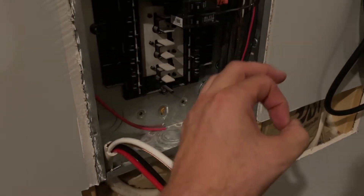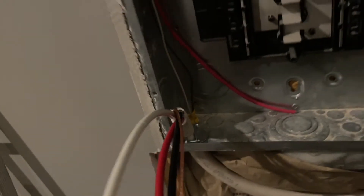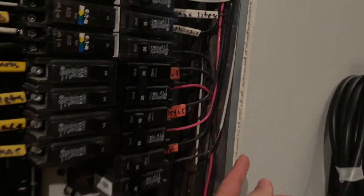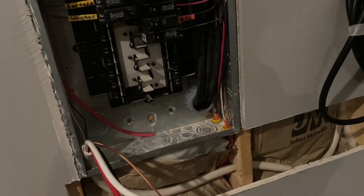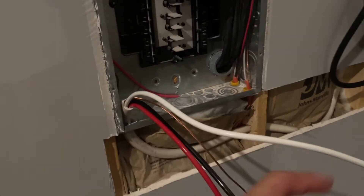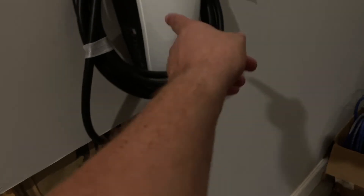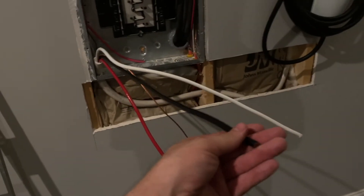Because this is a bigger wire, it requires a one-inch connector. It's a one-inch connector, and that's actually the maximum size conduit you could use for the Tesla charger. I couldn't find a connector that wouldn't require your hand on the back side to tighten a set screw on the connector underneath the panel. So if I did go through the side wall, the issue would be how do I connect the connector to the backside of the panel if I have a stud blocking that. So it just made sense that I would cut into the wall. The other option would be to come in through a knockout and run an external conduit into the charger on the exterior portion of the wall, which with this gauge wire I think I could get away with a one-inch PVC conduit.